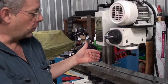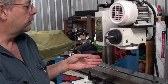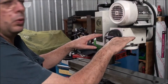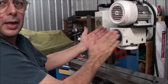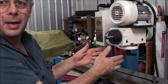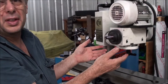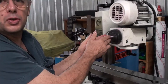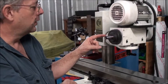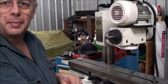So I'm pretty lucky here because I've got an X and a Y axis that I can move. The problem I'm dealing with is that I've got a spindle that can be up or down and it can be left or right. While I've got everything set out to the same numbers, that doesn't mean that it's close enough for actually measuring the taper. You'll see that in the results when I've measured one side and those numbers didn't make sense.